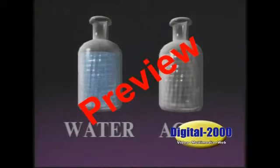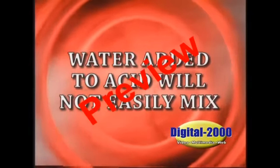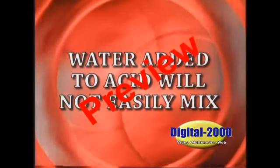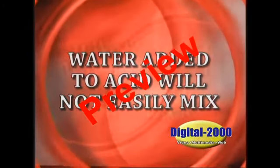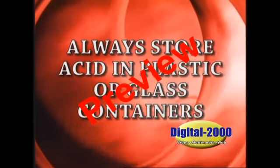When mixing acid to prepare electrolyte, always pour the acid slowly into the water and never pour water into the acid. If water is added to acid, it will not readily mix and will splash the acid due to the great differences in the specific gravity of the two liquids. Always store acid in plastic or glass containers.